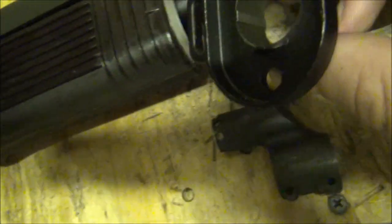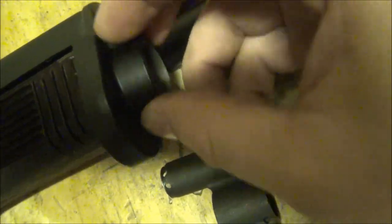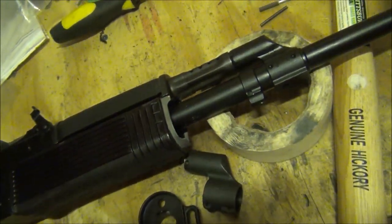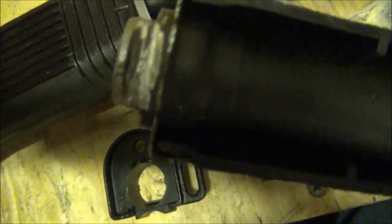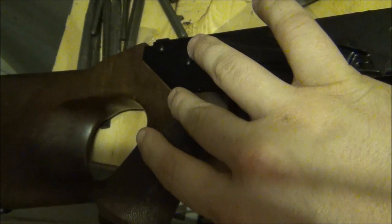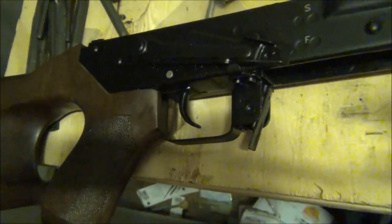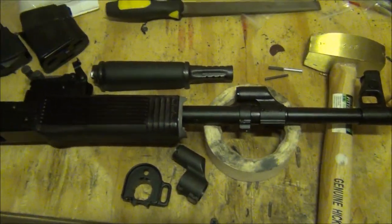I have this RPK handguard here, and I'm going to have to cut the barrel with the chainsaw file, just like you have to do with the Saigas. This really isn't much different than doing a Saiga conversion, and I've already fit this gas block. The gas block required some major fitting because this little notch here is a lot thinner on the RPKs. I'm going to leave the standard stock on there for now, but in the long run I'm going to weld up this receiver and put a standard US buttstock and US pistol grip. So this will be a 16-inch barrel RPK by the time I'm done with it.